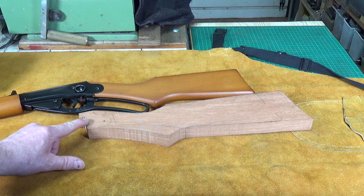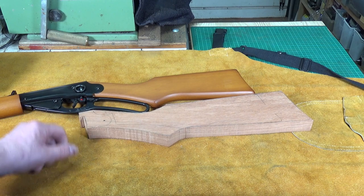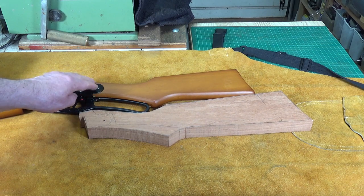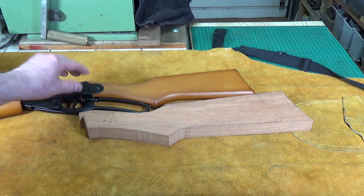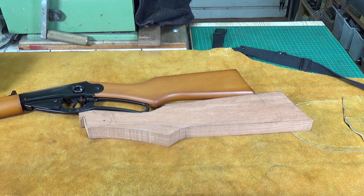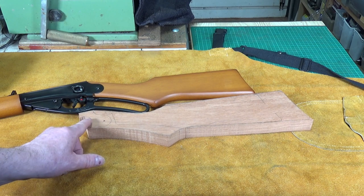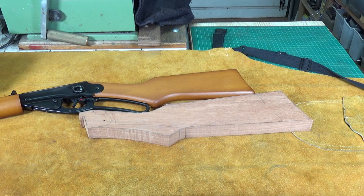Because it's about 4mm thicker, I'm going to have to rebate it — take a couple of millimeters off this part here and the same on the other side — so that it will fit into the main part of the receiver. I think I'll do the rebating before any sanding or shaping. I think I can do it on the mill, even though my milling machine is tiny. I'm obviously going to practice on another bit of wood first before I attempt it on this.